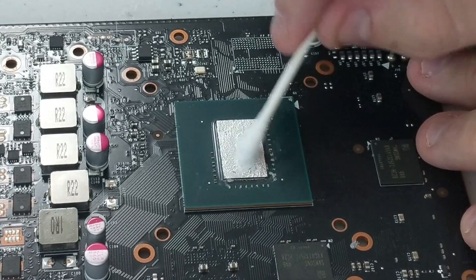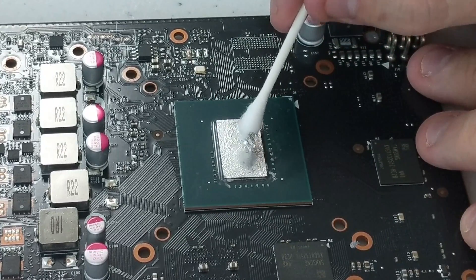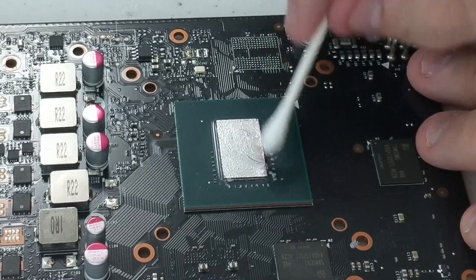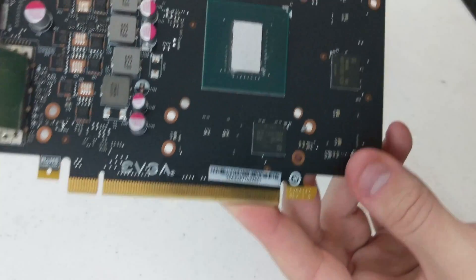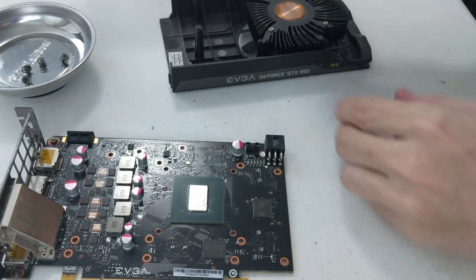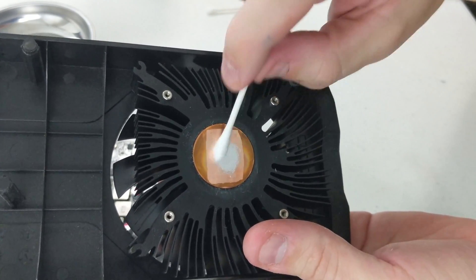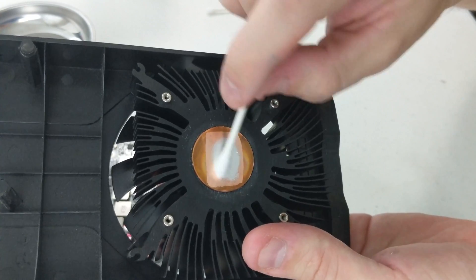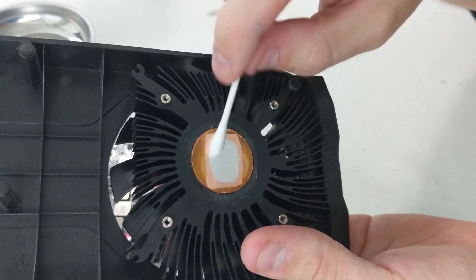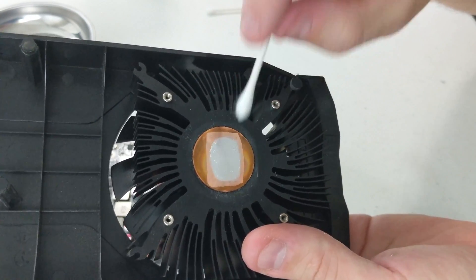It's a lot like water in that it grabs on to molecules of itself. This actually looks pretty good — there's a nice mirror finish going on. That is actually pretty good. Now, take the leftover on the Q-tip, take the copper plug, and just kind of spread it around on here — get the excess, spread it around. You don't have to put any extra on there; there's plenty left on the Q-tip. Make sure to go in different directions to get it in those crevices — that's the important part. Make sure it's getting into all the little crevices in the metal so it will make contact when you screw this thing back in.